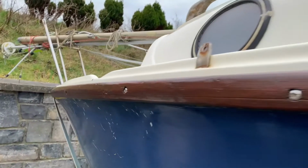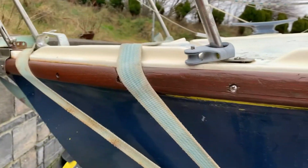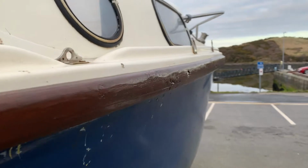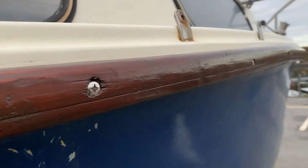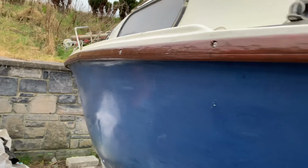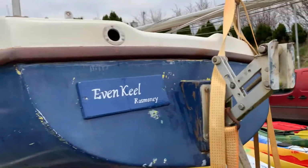It was all gone. All this hair was all gone, and I basically had to find another piece of timber that would do the job, and I had to shape it into the contours of the old one and then re-secure those bolts, all through bolts, for the cabin top and the hull deck sides to secure it back again, because it is structural. And then I stained it, gave it 3 coats of a 10-year stain, and did the whole lot all the way around.